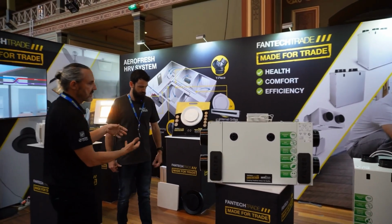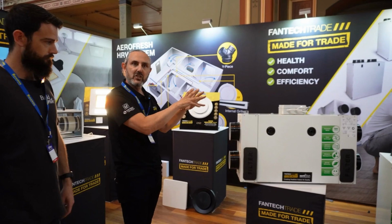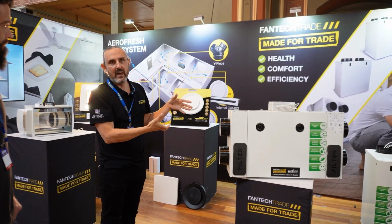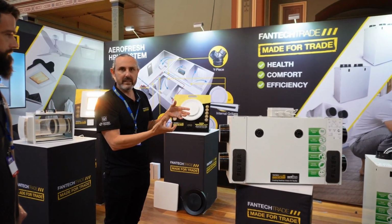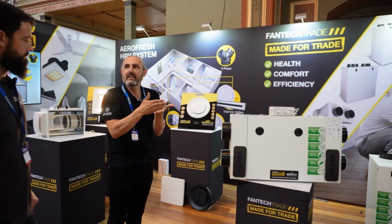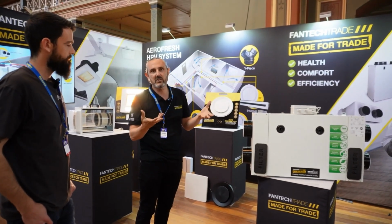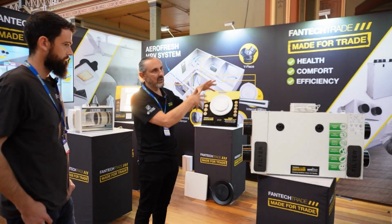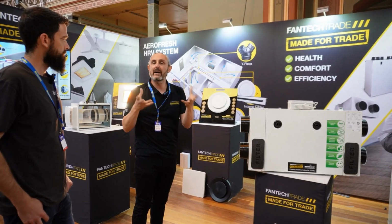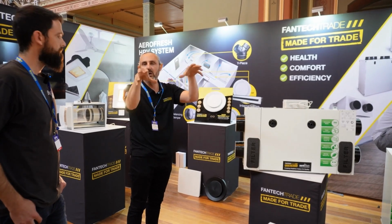Now with these systems, these have been designed really to use a larger diameter insulated flex. And the idea here is they're well suited to buildings that don't have service cavities necessarily. Because they haven't been designed at that stage, we've caught the project late in the piece, or it's a really tight budget arrangement where service cavities have been deemed an additional cost. In that instance, we can use branched insulated flex systems, a little bit like you might do for bathroom extract. When you use an inline fan, you'll have a Y-piece or BTO to service multiple rooms.